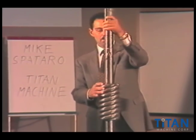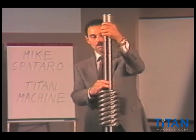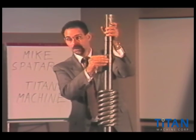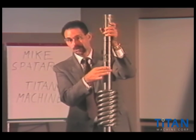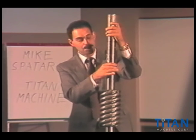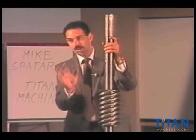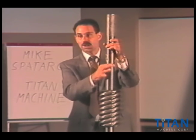Another area — while I've got it up here — this is an area that had been metal sprayed. Metal spraying has its applications, but we're not an advocate of metal spraying. If it does fail, it wipes out a lot of the components. Whereas regular steel shafting would just score up, with metal spraying, pieces of metal flake off and really do some destruction. That material can get into the gear teeth as well. You should be aware that metal spraying doesn't always have the best application with elevators — motor shafts may be a little better, but there's a lot of loading on worms, and that loading certainly affects the strength in this area.